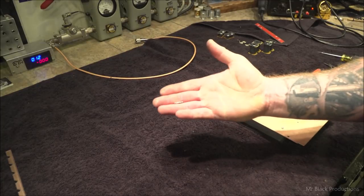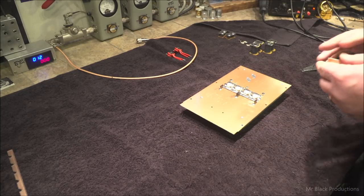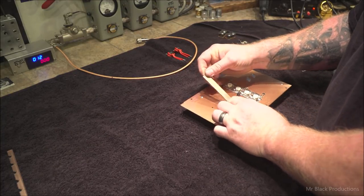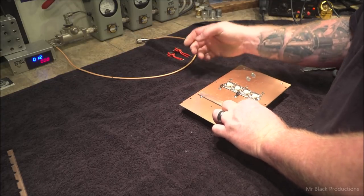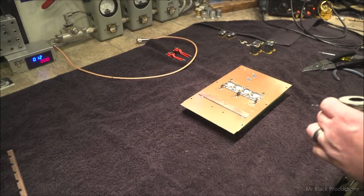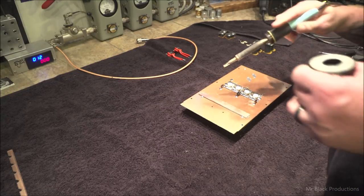Okay, let me make some solder because that's the last little bit I got. Everybody goes, what do you mean by make solder? Well, if you come here and you spend some time, I'll have you make solder as part of your spending time here process. I got this jig at the end of the workbench, and we take a bunch of solder and we twist it together very fine. The reason we do that is so we don't have to deal with the over splatter.